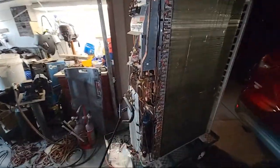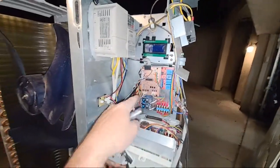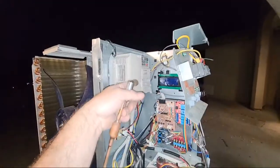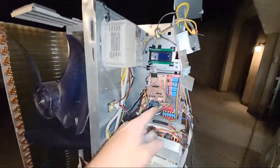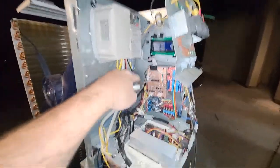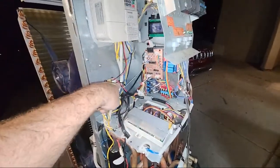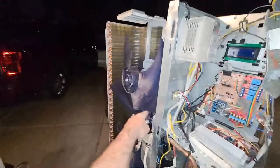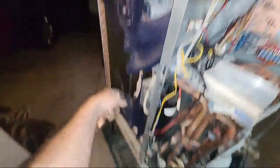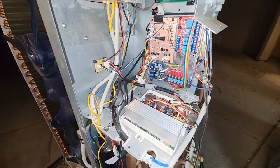So here's the progress — I'm about to invent one more wheel on this heat pump. I think the last video I did I showed you guys that I was able to use my controller to stage the two steps of the VFD which runs the three-phase compressor, and then I have the pulse-width-modulated output that goes over to my little adapter which interfaces to the fan controller — the case has an inverter controller for these two synchronous DC motors. They work great.